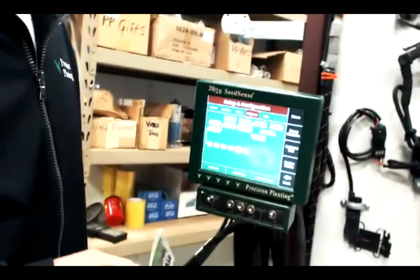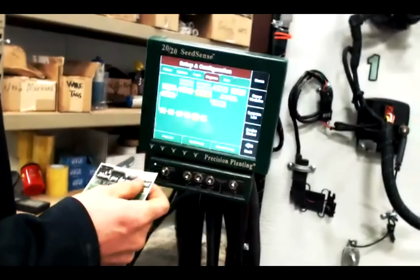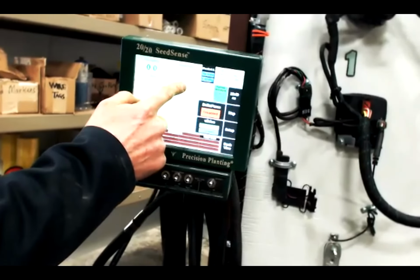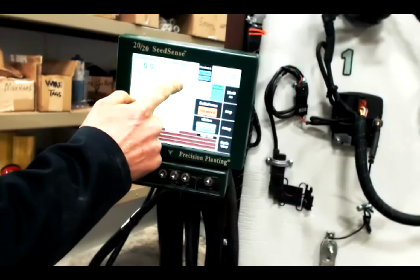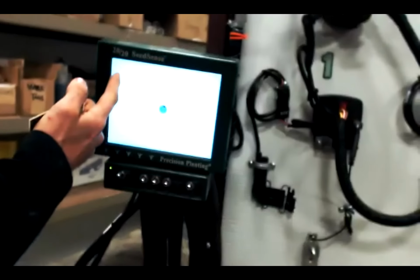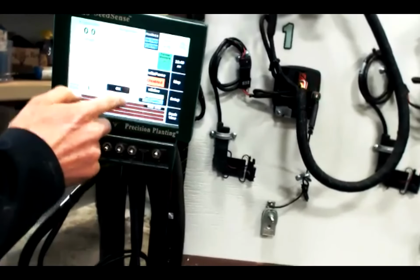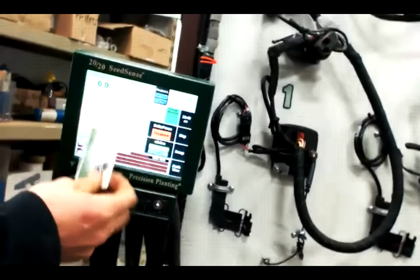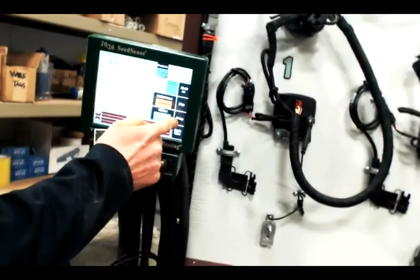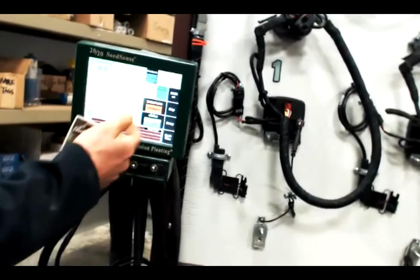One other little trick here around touchscreens and calibrating touchscreens. So Gen 1s or Gen 2s, at any time, if you just hold your finger on the screen for like 8 or 10 seconds and don't let go, it puts it into a calibration mode, and then you touch the crosshairs and it says successful. So that's good for Gen 1s and Gen 2s. If where you're touching on the screen, you know, the little X isn't following your finger push, that would make you maybe want to do that.